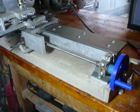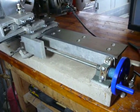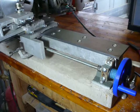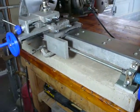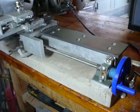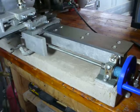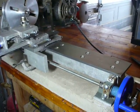I replaced the little piece of plywood this thing was screwed to with a cast piece of concrete. What I did was, as the concrete was starting to harden, I sat the lathe down on it. That put the imprint of the feet into the concrete, and then I just put some pieces of all-thread down into the casting, so that once the concrete hardened I could set it right back in that spot, bolt it down, and it wouldn't try and pull the bed out of true, because it had the top of it machined flat.